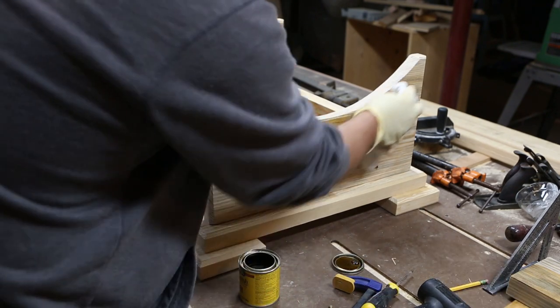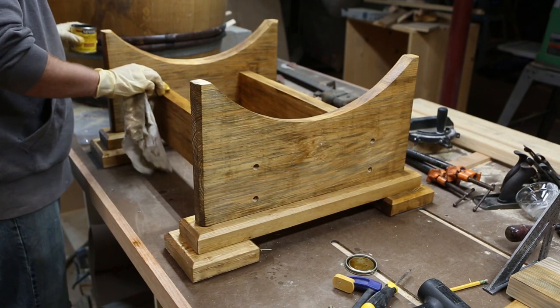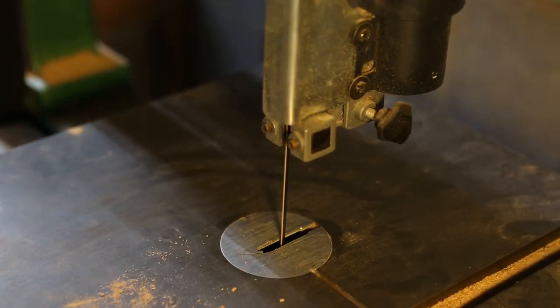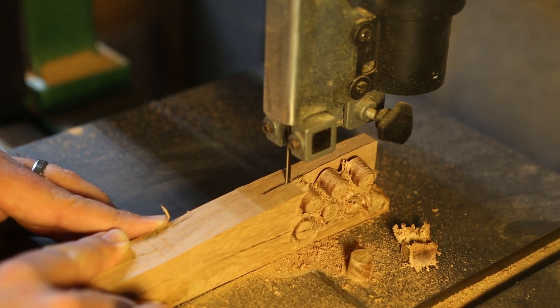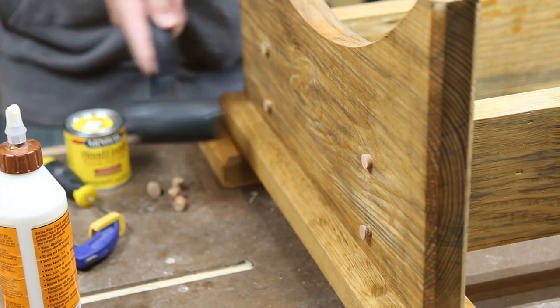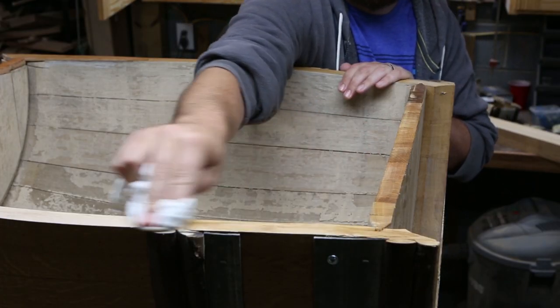To match the color of the barrel, I'm using Golden Oak Stain from Minwax. I'm using my half-inch plug cutter to make some oak plugs for those countersinks — I use plugs all the time. I'll put a link in the description to some plug cutters on Amazon. I'm just using Danish oil on that cut edge to darken it up a bit.